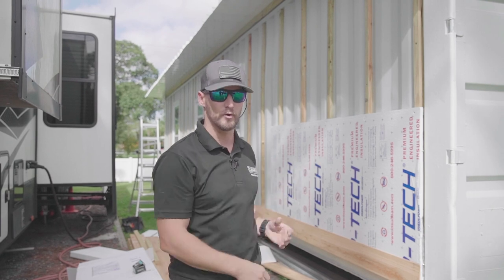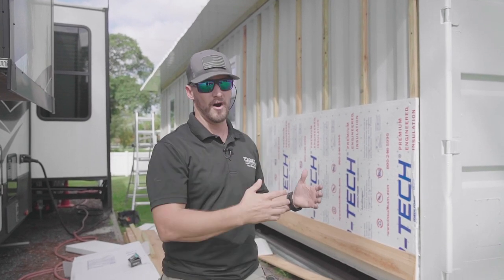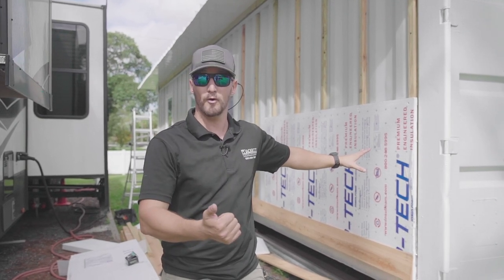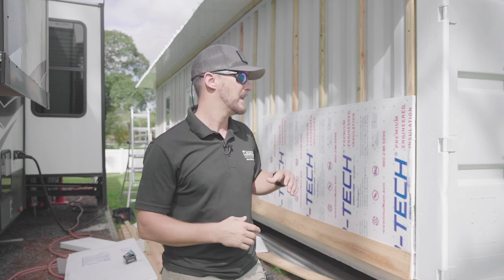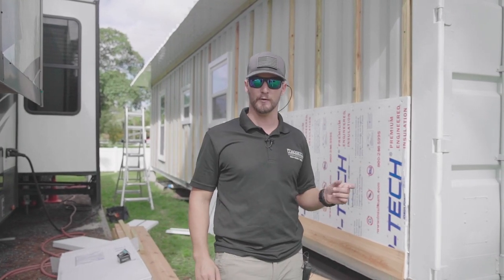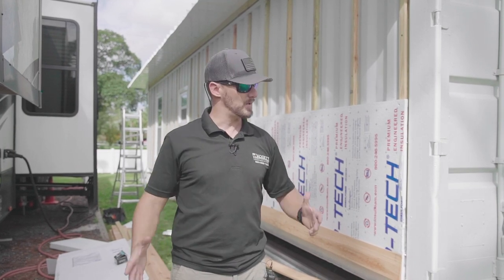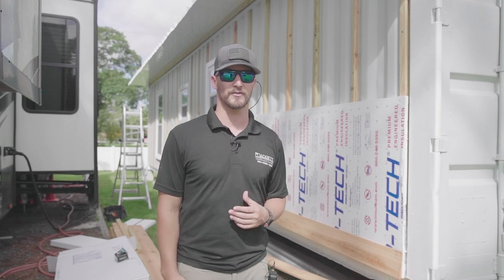That's about it for our insulation on the exterior with siding. I didn't have the help I was hoping to have today, so we kind of made do with showing you the basics of installing siding over insulation and a lot of the different types of insulation that you can and cannot use on your exterior and your interior. I hope it was helpful. Virtually, if you have a different type of siding — hardy board, cedar siding, or even if you were putting plywood over that and wanted to put lath and stucco — it's virtually the exact same concept. You're just taking into consideration the thickness of the board, the thickness of whatever insulation you used, and how deep you want to penetrate into that backing. That's about the basics; you should be able to apply that to anything you're doing. If you want to support us, we're an educational series so you can hit that Patreon account. Subscribe, share, and hit the bell — we'll see you guys on the next one.